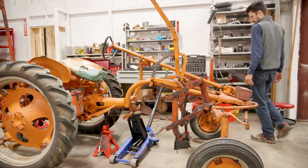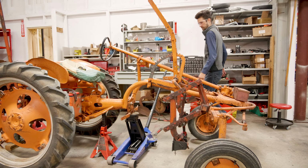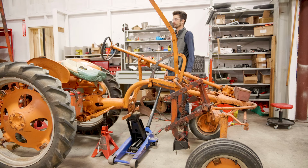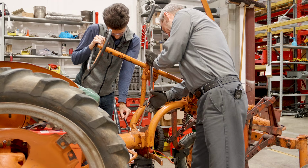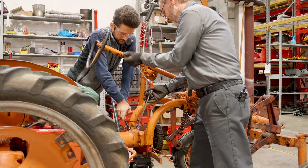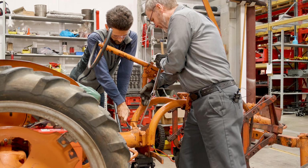So yeah, you can go put some liquid wrench or something on it to help start breaking it loose, or you can be impatient like us and use some bigger wrenches. Here we're gonna do a little bit of an in-the-field configuration for putting wrenches together, to give us a little more leverage. Got two 1-inch wrenches, just kind of together like so. See if we can get a little more leverage. See if this makes a difference.